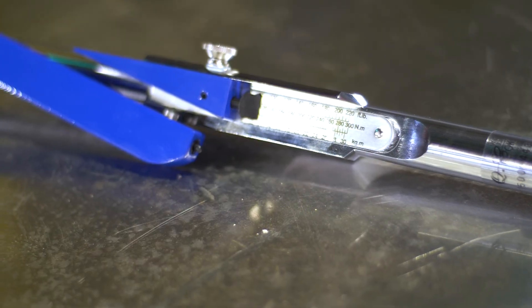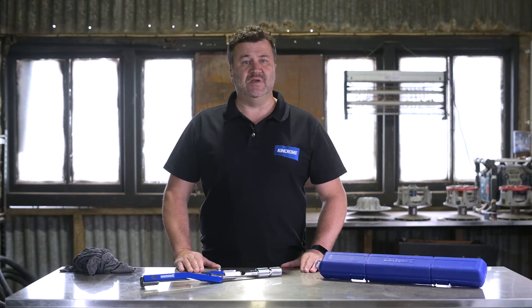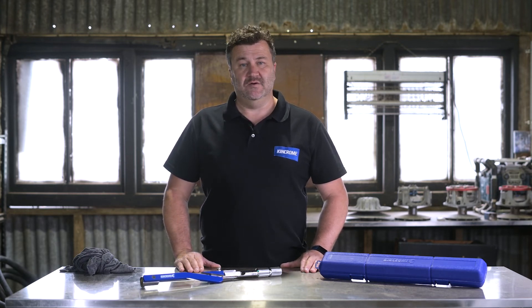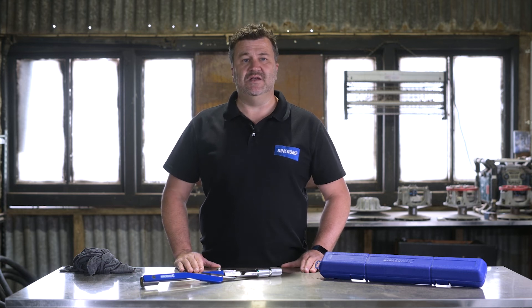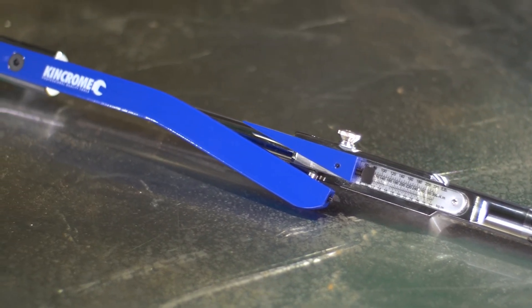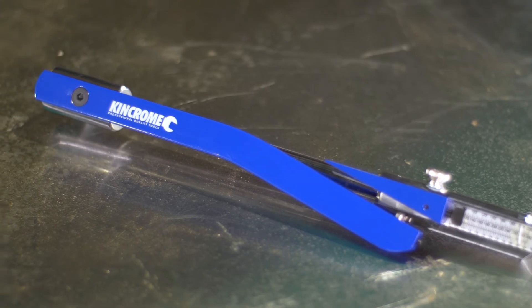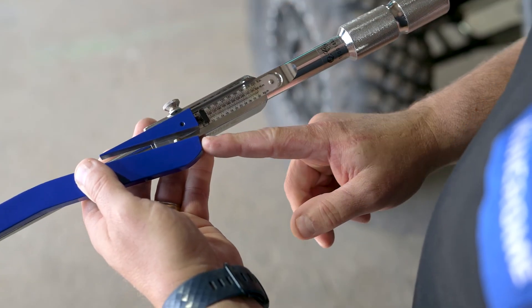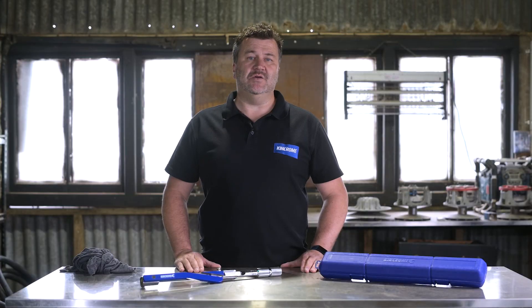There are several important tips regarding torque wrenches. The tool should be recalibrated every 10,000 cycles or every 12 months by a NATA approved facility. Refer to NATA.com.au for more information. If your torque wrench is dropped, knocked, or any part replaced, the wrench needs to be tested to ensure the calibration is correct prior to the next use. Always store your torque wrench with the indicator pin pushed in — this will protect the pin from breaking or being damaged.